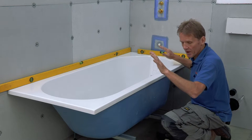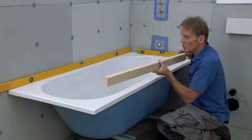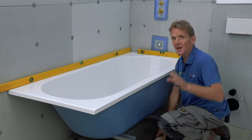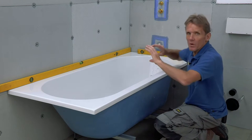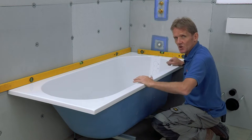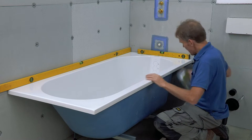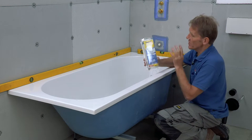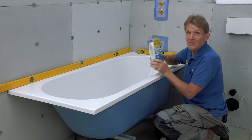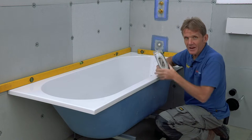So that's essential, and the next thing I do is make sure that I've got a good solid timber bearer behind that long edge at the back to stop any movement. When you come to put your sealing tape in and your silicon seal, you make sure there's no movement there, no stretch on the silicon joint. Then we've got this no-more-leak seal that goes all the way around the edge of the bath to give us that belt-and-braces second seal around the back edge.